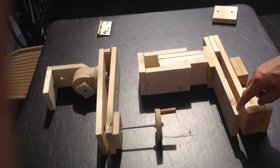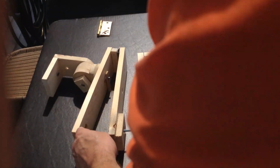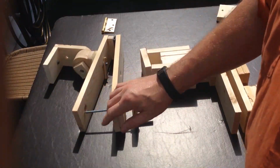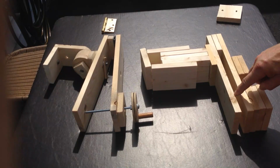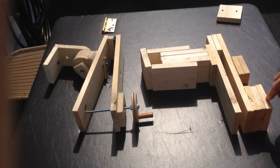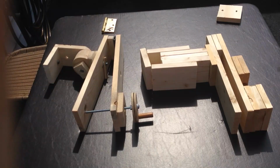And I'll take a metal plate and put under here to let that screw go up and hit and slide across. As this goes up, you can see the point here changes. While it hits right there, as it continues to go up, when it fully extends, it's going to be above that. So there's a certain place it's going to bind. So on this one, I want a metal plate to cover this area here, and that'll just scrape up the metal plate rather than across the wood or a hole in the wood. I think it'll operate smoother. Seriously considering building this with two screws, one here for 1/4-20 and one about here for 3/8-24. If I build them both into the same thing, I can use them both, just never together.